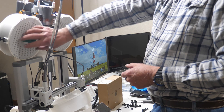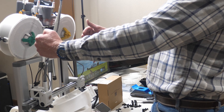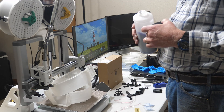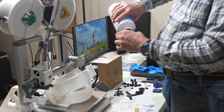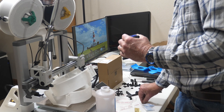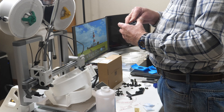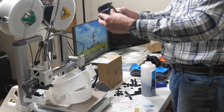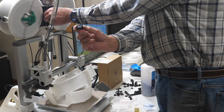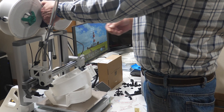I have not had a problem with spools coming off on the other side — it's just been on positions three and four, probably a little because of gravity. Each side has a place for a desiccant container with a lid that prints with it. I'll fill this up with desiccant — a couple of little beads are hard to pick up — and then the little cover slides over the top. It fits into an indent inside, and then you have horseshoe-style clips, one at the top and one at the bottom, and they snap in.